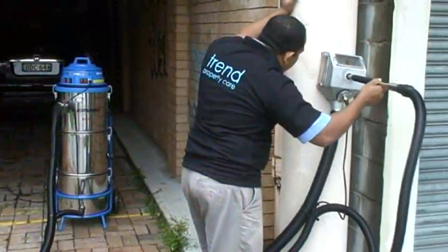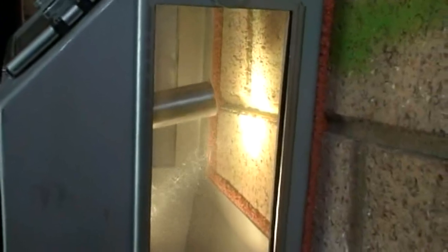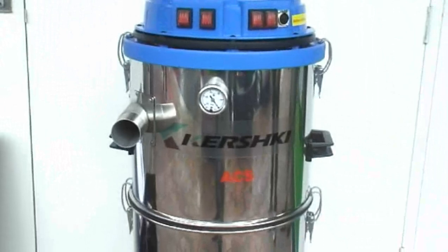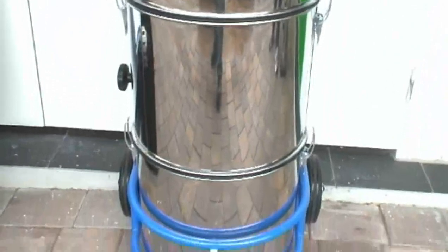It is designed as a mobile compact device, not bigger than a customary industrial vacuum cleaner. Once the hood is set on the working surface, the Jetlance blasts material onto the surface to roughen up or clean off the layers. Immediately after impact on the working surface, the blast medium is sucked together with the removed particles into the machine and filtered through each of the three separate containers.